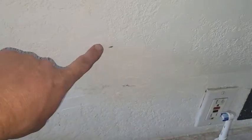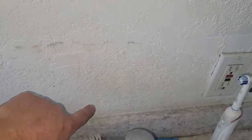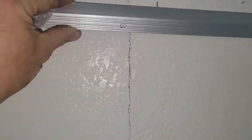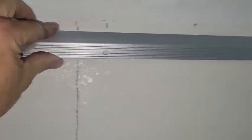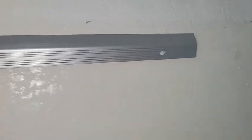Now if you want to make it lower, closer to the backsplash of your sink, you can do that. You can just adjust where you want to put the mount. Make sure you have a leveler when you mount the holes. We'll put the center hole here. There's the center. So we'll put that center hole in first, and then we'll put a level on it and make it level. Then we'll put the 2 side markings, determine where the holes are.